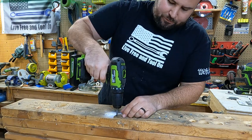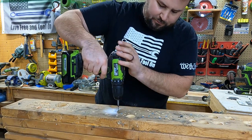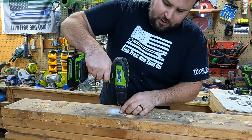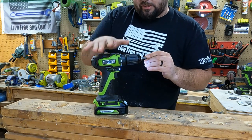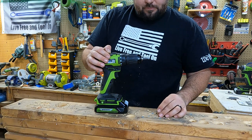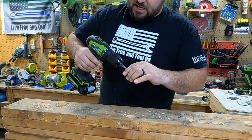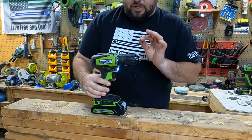Now that's on the number one setting — that's with the power. Let's see if it's the same. We'll set the chuck all the way back down for the number two setting, which is the speed setting. It did very well — the clutch kicked in for that. Let's go ahead and kick that up to eight to see if that'll do the same. I would say it's even a little bit weaker but with a little bit more controllability on the fast setting. I always like to drill these on the slow setting. Let's jump into a one-and-five-eighths inch screw, set to level 14. No problems — that drove it in right flush on the number two setting.